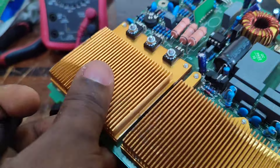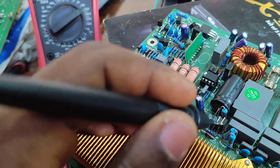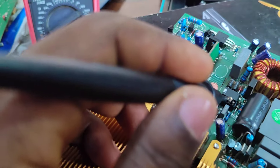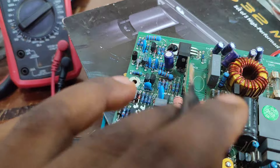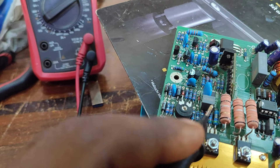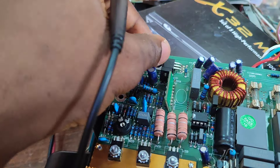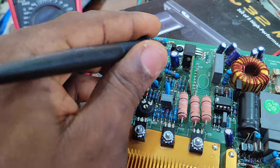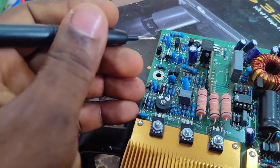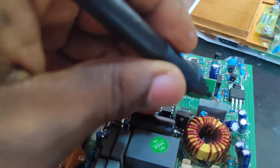On the other half, same approach but different components. This diode was bad — I didn't change the other ones as they were okay. I noticed this chip is bad as well. After changing them, the voltages were not coming right, so I checked in-depth again and found that transistor BC549 was gone. There was also a diode I had to replace.